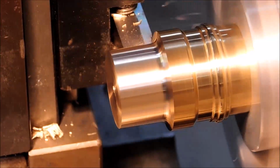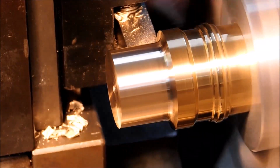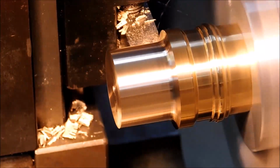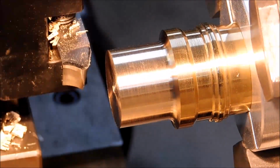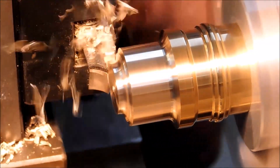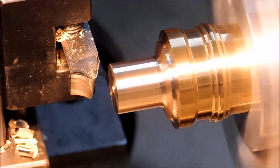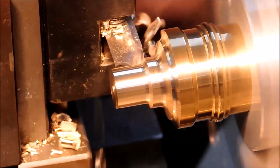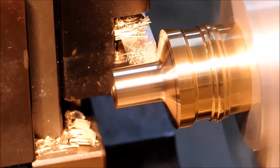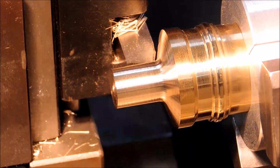First thing I'm going to do here is to establish the shoulder distance on the end of the barrel. This is where the fuse would be lit. And this is strictly by eye. Now remember, the deeper you go with that tool, the farther that projected angle is going to go back. So you need to be real careful and put some kind of a witness material or mark or something on there so that you can see what's going on. And that's why the Sharpie was put there.